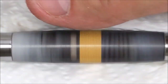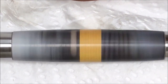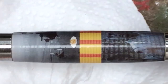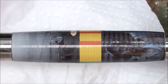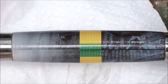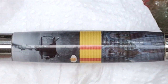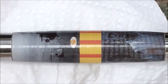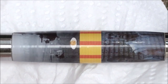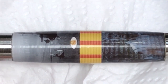There's the first pad and it's already starting to look nice. I'll finish up with the other pads and come back to show you what this blank looks like once I've run through all nine pads. I just finished polishing this blank with the micromesh — it looks amazing, a lot of detail in this blank. You've got the Vietnam Wall down at the bottom, a helicopter up at the top, the service ribbon across the middle, and of course the grain of sand. It's a beautiful blank. I'm going to go ahead now and buff it up with a little Renaissance wax, and then we should be ready to run it across the buffing wheels and assemble it.